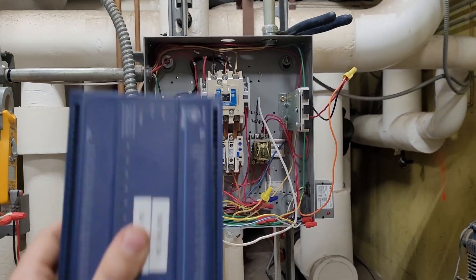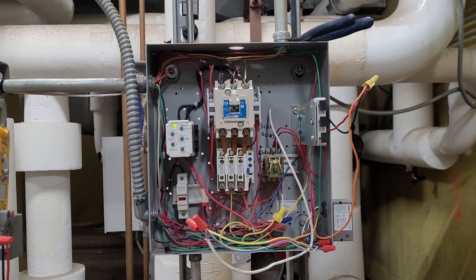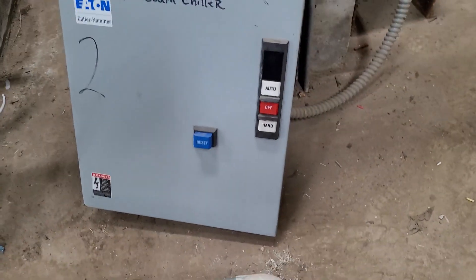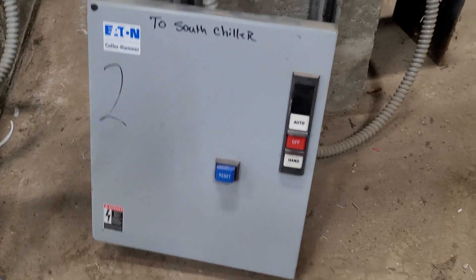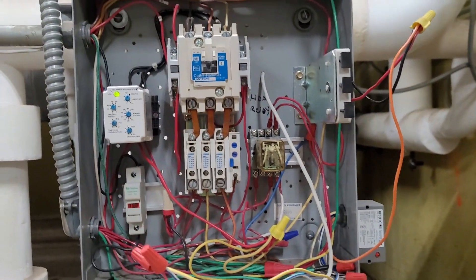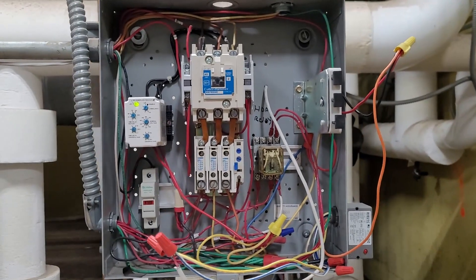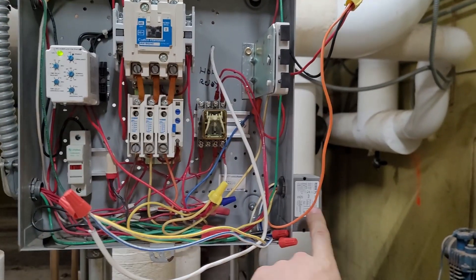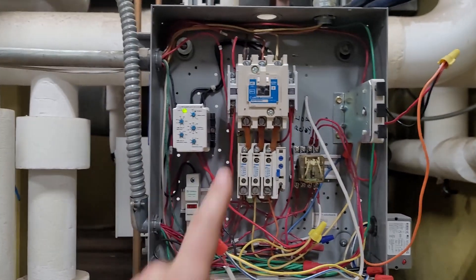Today I'm putting a DISTEC controller on a chill water system. The chill water pump contactor has historically been controlled by the chiller via a hand-off-auto switch — as long as the auto function is depressed, the chiller can send voltage to a relay to enable the pumps and the ISO valve. The new DISTEC controller is going to have pump control in parallel with the chiller, so the chiller will still be tied into the auto function, but I've also added a relay so that the plant controller can bring on the pumps and open the ISO valves even when the chiller is not running.